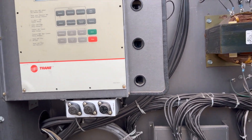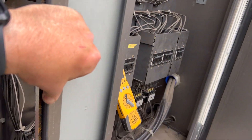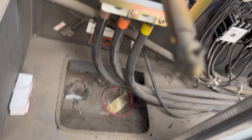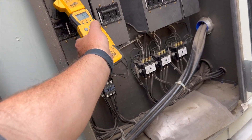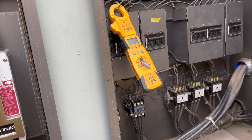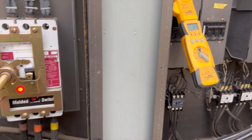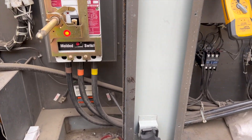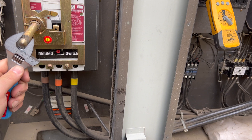I hit stop because I forgot to turn off the circuit last time — that's why the compressors came on right away. But the good news is that compressor stayed running. We may have freed it up. My meter battery is low, but we're going to go ahead and kill the power and flip our wires back, then go from there.